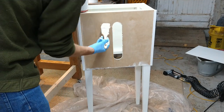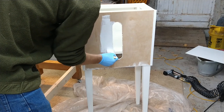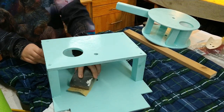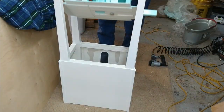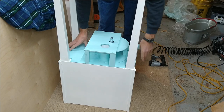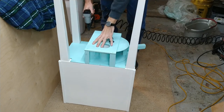Once we finished building it we moved on to painting. The box itself we just covered with some latex paint that we had lying around and some primer as well. On the inside we glued in a piece of plexiglass — really just for that window to see the level of the dog food so we know when to refill. The moving parts we spray painted a different color, and this is a shot of my son sanding that. We sanded to 400 grit just so everything would have a nice smooth surface to move along. Here's the final assembly — installing the mechanism on the bottom of the box, making sure everything moves freely, and then it's really just some wood glue and some brads to hold the whole thing together.